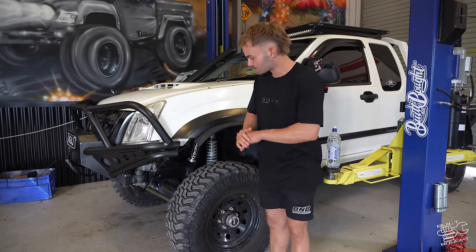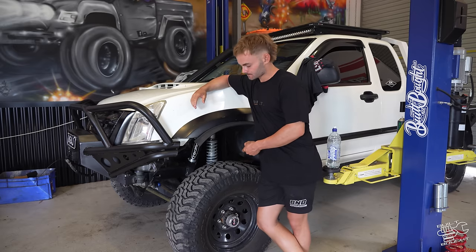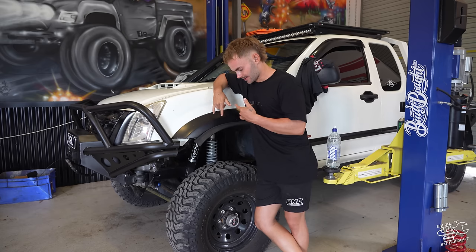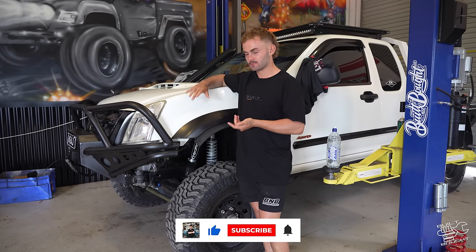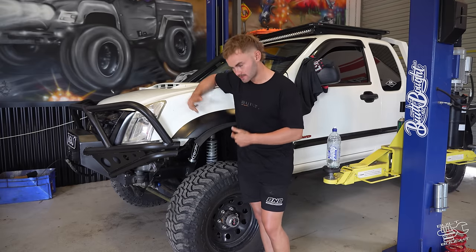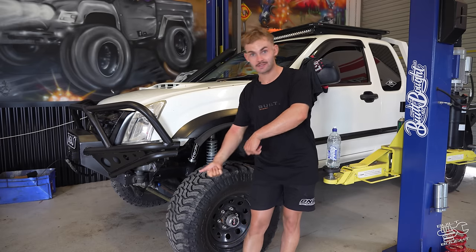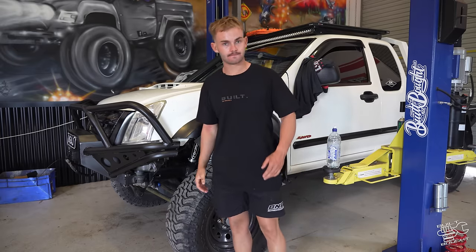With the new bull bar and winch, it's absolutely sagged the front of my ute. She's sniffing hard now. I'm currently running 250, 300 weight coils in my coilovers, and I'm going to have to change up a fair few coil weights. I spoke to a few SAS D-Max boys, and they're talking about running 450, 350s, a 100 kilo spring spread, so you get softer over small bumps and it stiffens up on harder bumps. Or you can go more traditional and run 400, 350s or 450, 400s. It's one of those things you really have to experiment with, and at $800 a set of coils, it's not a cheap experiment, but that's what we get being SAS boys. We lost the IFS problems and now we've gained solid axle problems, but that's all right. Anyway, enough of that. Let's hook a winch up.